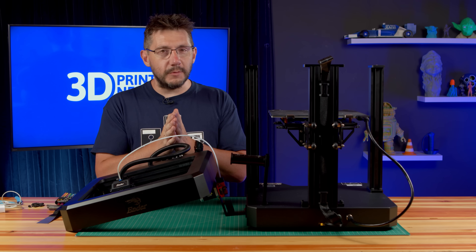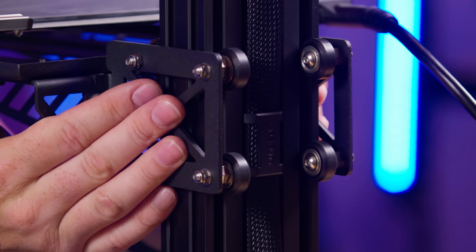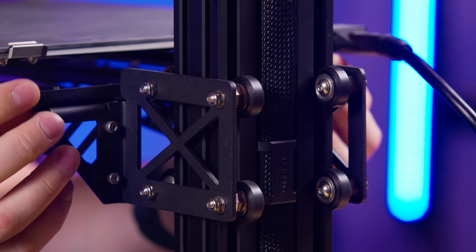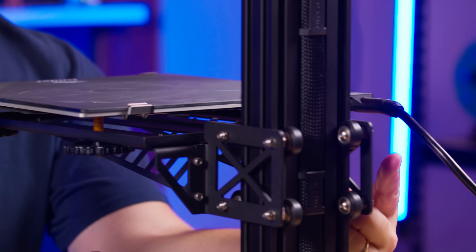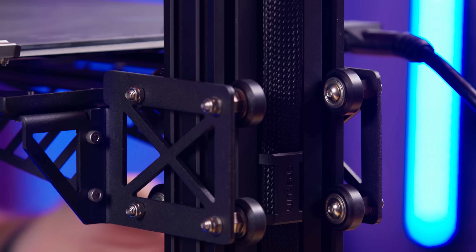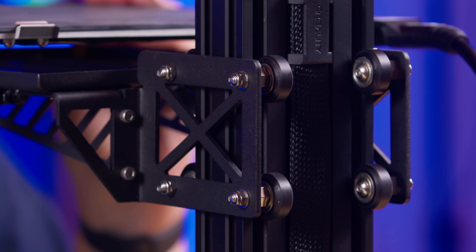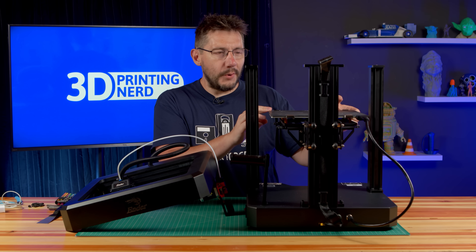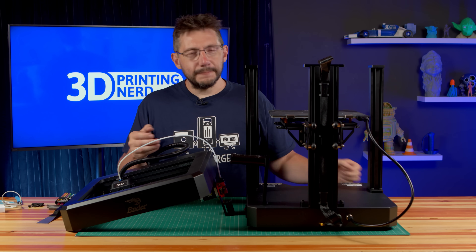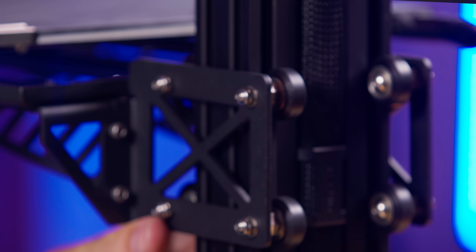There are three main issues we need to deal with in this video. The first is the bed mechanism. This part connects up with these metal brackets and then up to this bed. These are separate pieces, so if something heavy is on the bed or there's a bit of flex — you can see them move up and down. If one side is significantly heavier than the other, there's a chance it bows and you'd have a failed print. I think Creality should update this mechanism to be more sturdy.